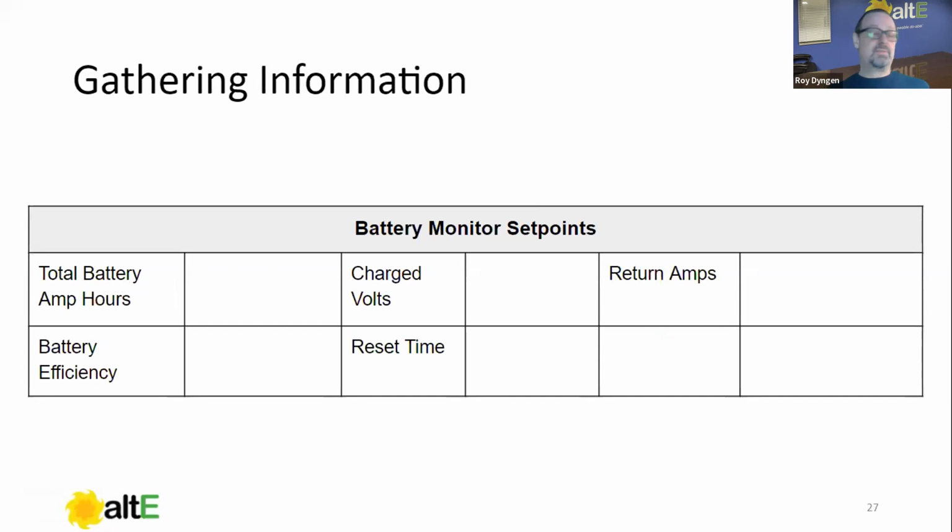because, my feeling is that the reset parameters are more important. And over time, this number is going to change anyway. My own view, you can play with this one a little bit, I set it for 85%, always. Gives you a little bit of headroom if it's better. And if it's not that good, like if you have some old lead acid batteries, for instance, we're still going to straighten things out with our reset parameters.